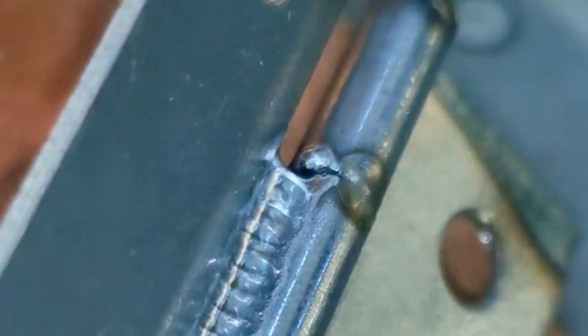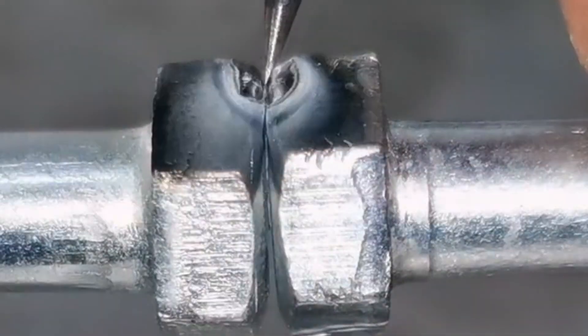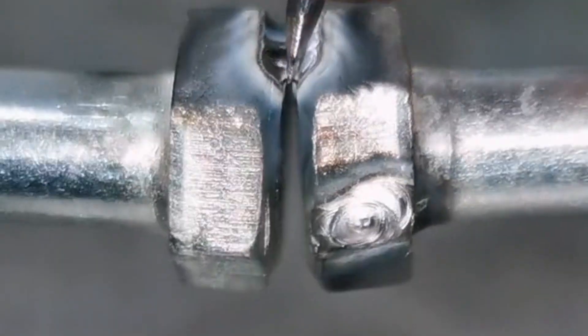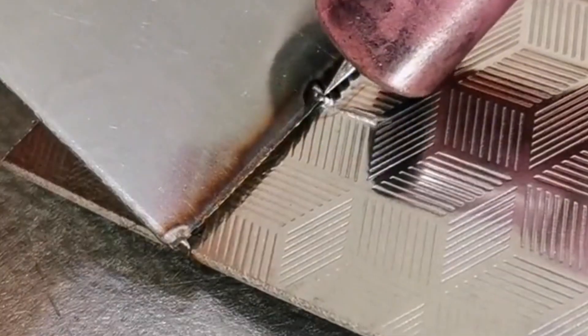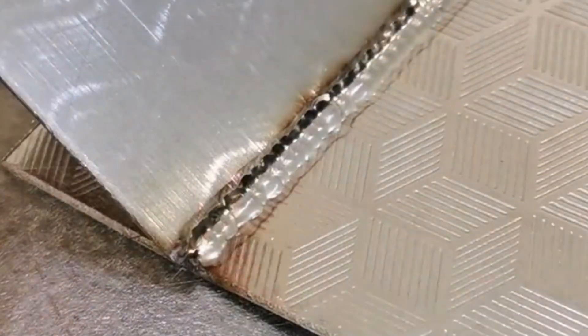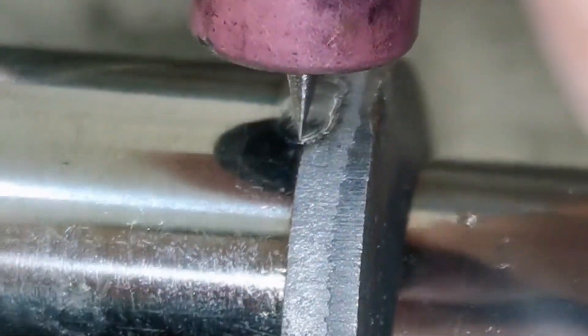The focus of these two welding machines is different. Precision repair welding machines focus on welding and can also perform surfacing. EDM welding repair machines focus on surfacing. In the casting repair category, there is a cold welding machine that uses the principle of resistance heating to attach stainless steel sheets to repair mold defects — that is, tool and mold repairing machines. There is also an electric spark surfacing repair machine that uses the principle of high-frequency electric spark discharge to repair metal defects.